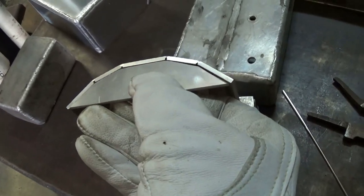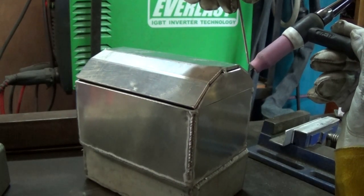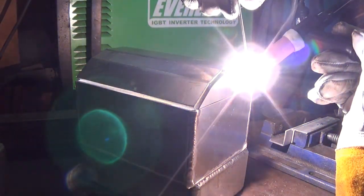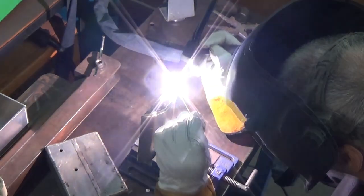The lid's next, and this also progresses reasonably well. To get the lid width to match up with the base, I'm just sitting it on top of the base while I do the final tacks on the end, before I then weld up all the seams. Silly me.